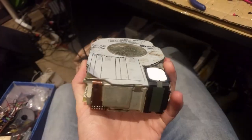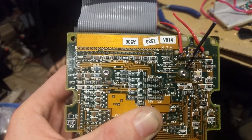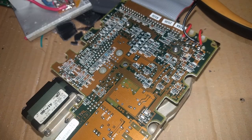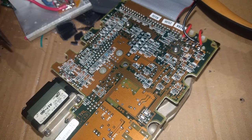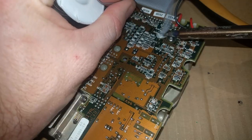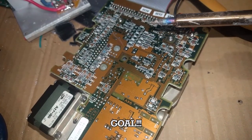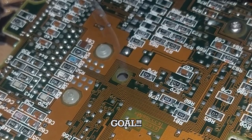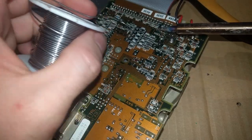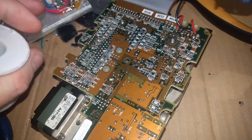I don't have any 10-ohm resistors, so I've only got some 70s and they're a bit big. As unlikely as it sounds, this IBM XT hard drive is actually coming to the rescue — it has a whole bunch of SMD resistors that are perfect for our gate drive resistor. We're going to use two that are 100 ohms for the gate drives. SMD soldering isn't easy, but when you're working in this sort of 80s technology level, it's not too hard either — you can at least still see the parts. Oh, I just found some 10-ohm resistors. Actually, we're going to use those — that's much better.